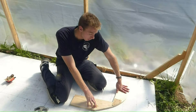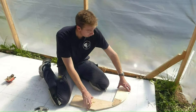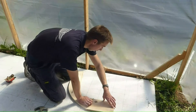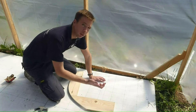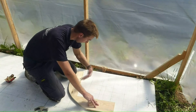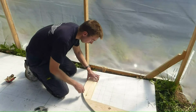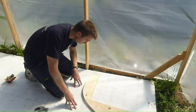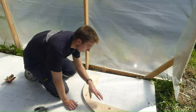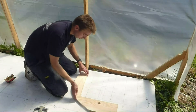The reason why it's important to mark the waterlines is because of how I'm going to attach the other piece of wood. I'm going to flip this over and attach this other piece, and I obviously need to do the same thing over again - put the pin nails in and pick up the points. But because we want these two pieces to be exactly the same, I need to know how to line up this edge with station mold one. Station mold one isn't drawn over here because we only draw them in half breadth. That's why I need to have the centerline marked, and all the waterlines marked, because that way I know exactly where it goes without having to match this edge up to a line.